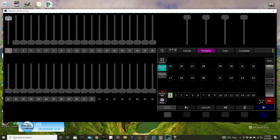Again, I'll show this in another video, but as we move number 1 up, it would be turning fixture number 1 on. This would turn fixture 2 on, fixture 3, and so forth, all the way up to fixture 16 on the front pipe. And if I got to fixture 17, that would be the beginning of the second row. Now if you direct your attention down here, you'll see that in this case 17 changes its intensity as I change its intensity. And the fact that it goes out completely tells me I'm at 0. 18, it'll go all the way up to 100 and so forth.